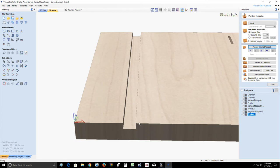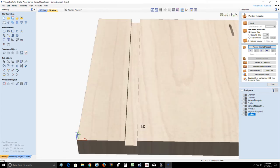We're going to have to look and see, one, we need to check the calibration on your machine, if we haven't done so, or if you haven't done so. We need to make sure that when we're stepping over, we're stepping over the appropriate amount, the steps per unit. When we tell that machine to move a quarter, it's actually moving a quarter. And we need to adjust the calibration.